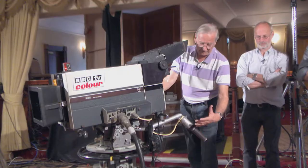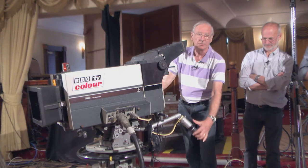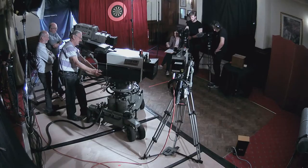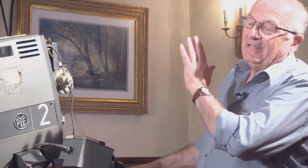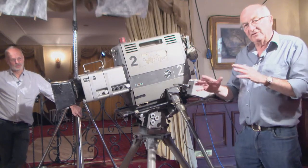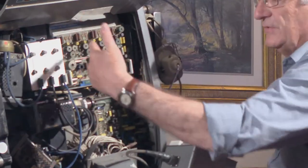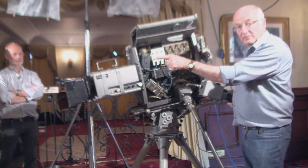That's one of the most important processes on outside broadcasts - making sure the lens tracks throughout the whole range and stays in focus. You've got the zoom control, and normally for a British cameraman it's in the left hand - that's the pan bar - and the focus control on the right hand side. This camera is principally the same but we didn't have four tubes; we had three tubes using red, green and blue, and from those we used to derive a luminance or black and white picture, which was the extra tube they had in that one.